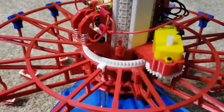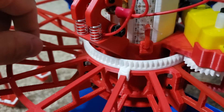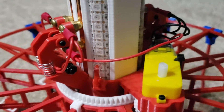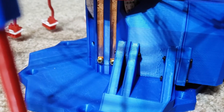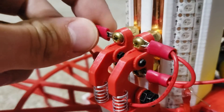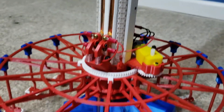The carousel motion, or the spinning motion, is driven by this DC motor here. It's got a gear on it and then it has a gear going around the carousel or the chassis to spin it around. This is powered by bus rails which I made myself. It uses copper tape which at the bottom are attached to screws with leads on them, and on this side is attached to acorn nuts and screws which are attached to the leads on this side, which attach to the motor. So it gets power through these rails all the time.